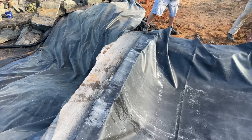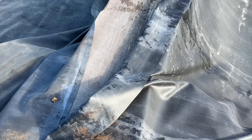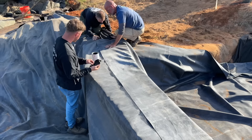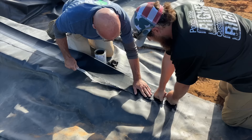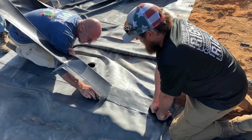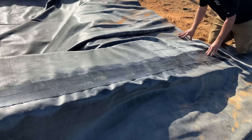Next up is a critical step in the pond build — seaming two pieces of liner together. When you have a pond built in this shape, you won't have a single liner covering every portion. We covered the main body with one big chunk of liner, and the guys are going to use sealing tape to seal these last two pieces together. That's really important because if there was a crease or hole between the two liners, water coming down the waterfall could leak out and get beneath the liner. The guys took their time, cleaned everything off, used glue, and slowly applied the tape. I've got full confidence we won't have any leaks.